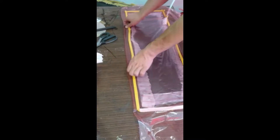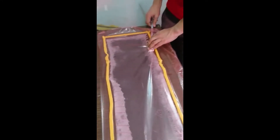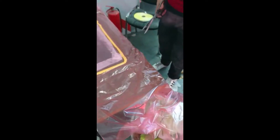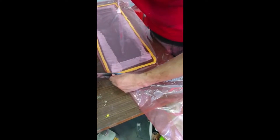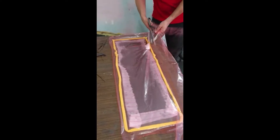We tried to make these processed plates perfect by sanding them with sandpaper. Then we finalized our body using carbon fiber and epoxy with the vacuum bagging method. Vacuum bagging is the clamping method that uses atmospheric pressure to hold the epoxy coating components of the laminate in place until the epoxy cures.